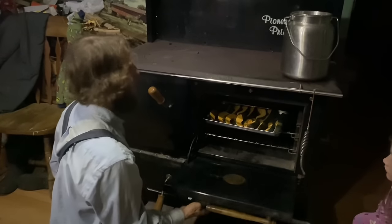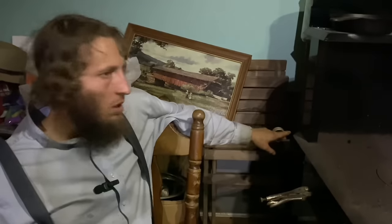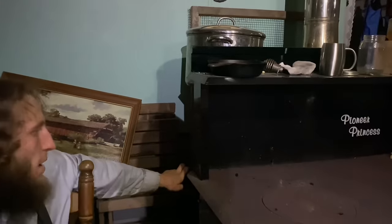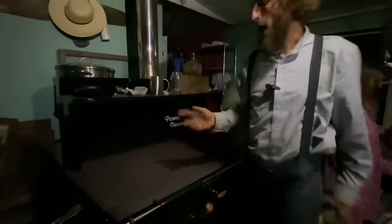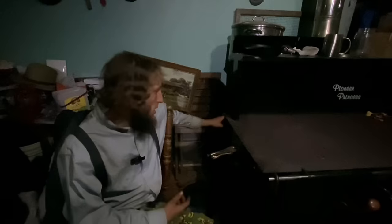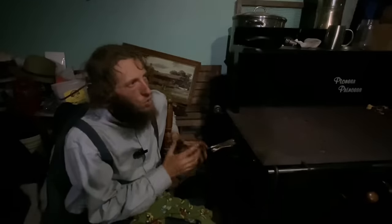Most wood cook stoves have this damper. When the damper is out, the smoke goes directly from the firebox across and up the pipe. But if you push the damper in, it forces the smoke to go over the top, down the side, around and underneath the oven, then out the pipe. You don't have to push it in to bake, but if you're wanting to bake things faster it's a good idea — it forces the heat to go around the oven box. Does the pumpkin become sweeter after it goes through the heat?